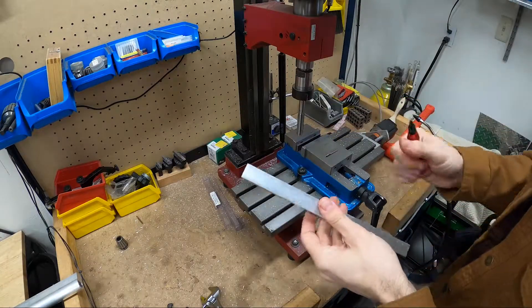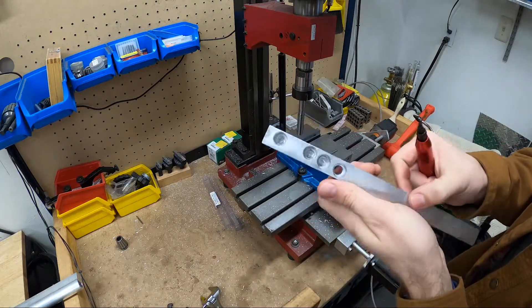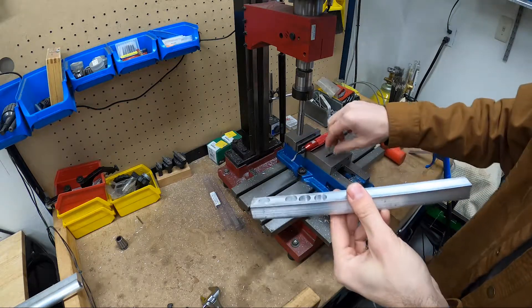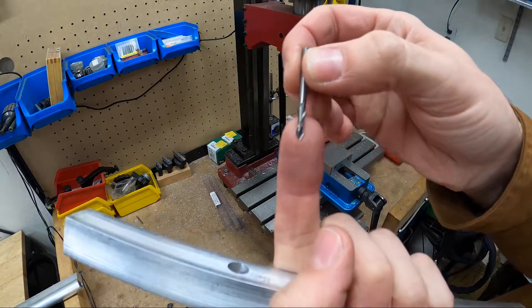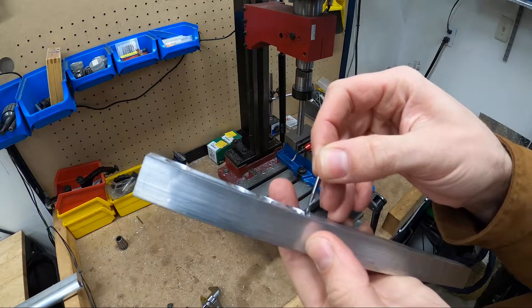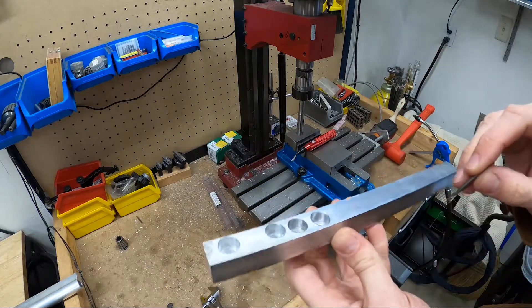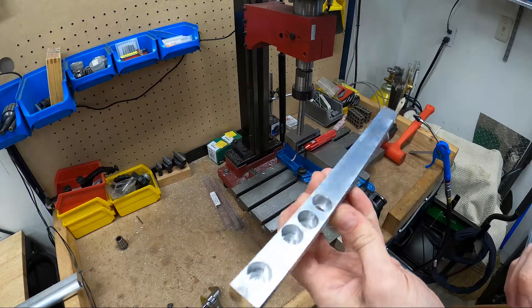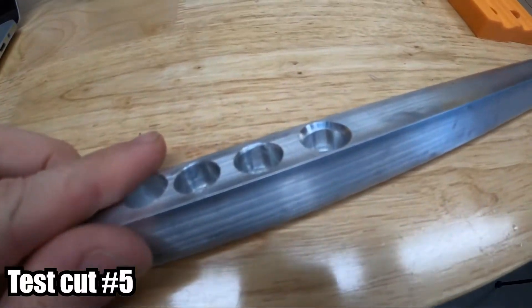I just tried to add a little bit of a lead-in with the deburring tool I just got and I wound up scratching the inside freshly reamed surface. So I dug through my tools and I have this 1/8-inch 60-degree V-bit — I'm going to try and add a lead-in chamfer with the CNC so it's more consistent and I don't have to do it by hand. I'll do that before I ream. I did finish the chamfer — it worked out pretty well.